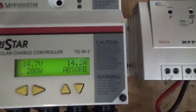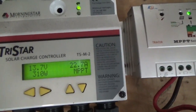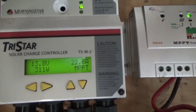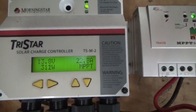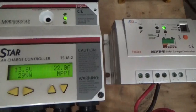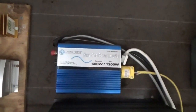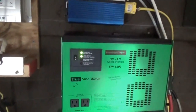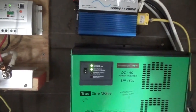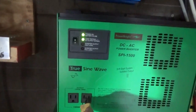Look at the current kick up — there it kicked in. Now we're back in MPPT mode. We have 1200 watts of solar panels out there and we're not pulling in much because we haven't been using anything. Unplug it. That is too much surge for this little inverter. The green inverter, since we had the lightning strike, has been giving me issues — let me see if it will work.